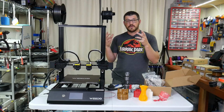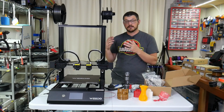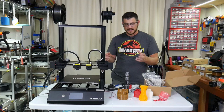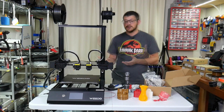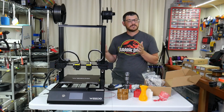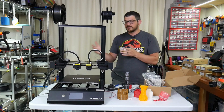So I have found a community version of Prusa Slicer, and I've been working off of that to make my version. I'm getting this to print a little bit faster than its default configuration. So again, that's why I'm getting a little bit of the ghosting, but I'm getting decent prints at that speed. I'm able to get the dual color to work just fine, but I just cannot get the duplication mode to work, which is really frustrating.